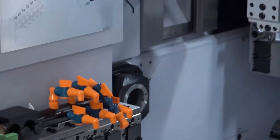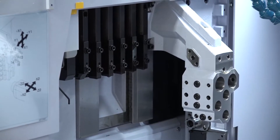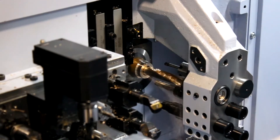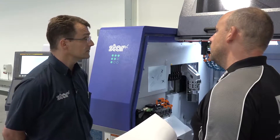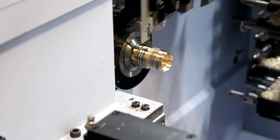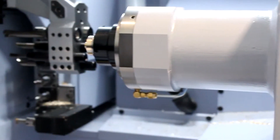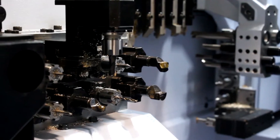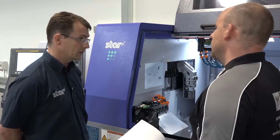What are the differences with this model in terms of the tooling layout? The drilling arm has gone from four to five stations. On the backworking, the Type A has gone from four to six, and the Type B goes from four to eight. We're now using ER20 spindles on the crossworking instead of ER16, so we can get bigger lumps of carbide in the machine to work with that extra power. The Type B model has a Y2-axis, giving it eight driven tools, whereas the Type A has no Y-axis. On the previous SR, we had four fixed spindles on the backworking.